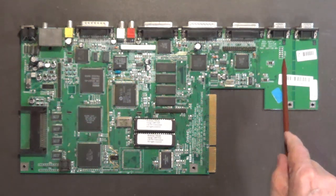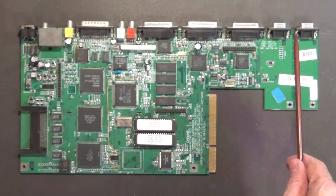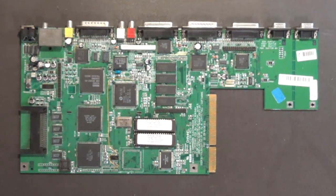So when I put the high-density drive in here, this computer will read and write 1.76 megabyte Amiga high-density disks, as well as the 880K Amiga disks. So yeah, that'd be a nice feature, because Kickstart 3.1 and Amiga OS 3.9 can handle the high-density disks with no problem, as long as you have a high-density drive installed, and that's what I'm going to install in this. And then I'll put the whole motherboard into that new blue Amiga 1200 case that I've shown. I did a video on that case, and it's on my channel if you want to go watch it.